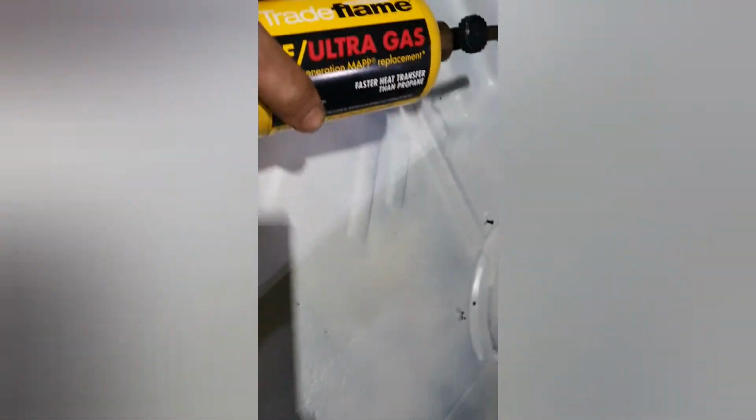Everything just gets the torch run over it, nice and fast. If you leave it there too long, like high temperature paints that we work with in exhaust, any of your enamel based paints, they'll actually lift with paint. On old boats you used to use blow torches to get rid of the old paint, same on houses, lead paint used to come off with the blow torch as well. We just want to waver around, heat the product up a bit, speed up the reaction time. Like I say, this is not recommended by anyone, but I've done it several times, and it works, man. It really, really works.